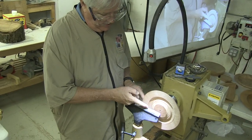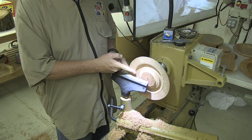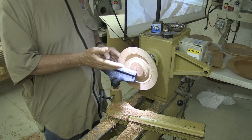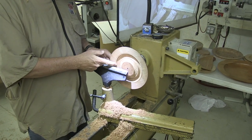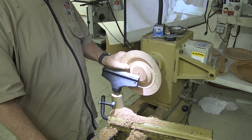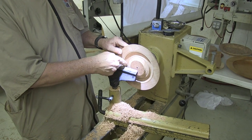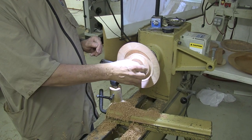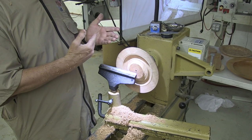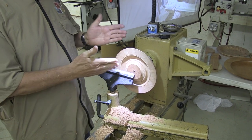I intended to get this surface right here of the bead below the surface I'm going to sand here on the rim, so that when I'm sanding the rim, I'm not messing up the bead. And if I didn't succeed in doing that, I'll mess around with this until I do. And I've also got an easy separation for sanding the inside because I have a kerf there,